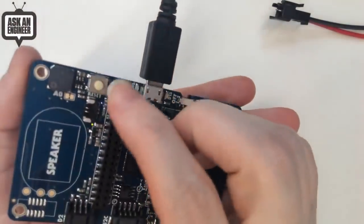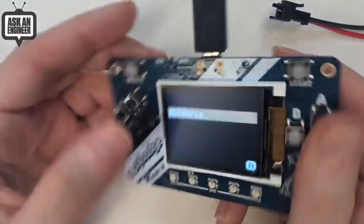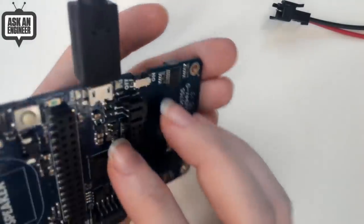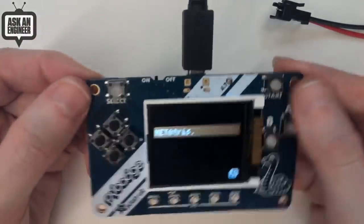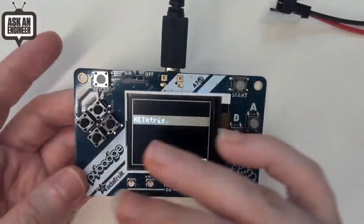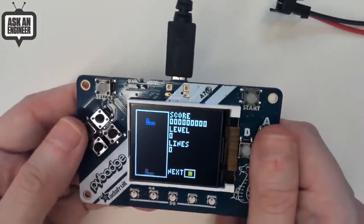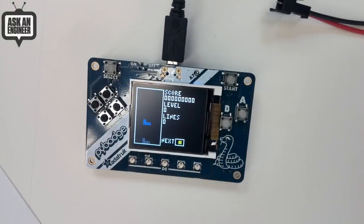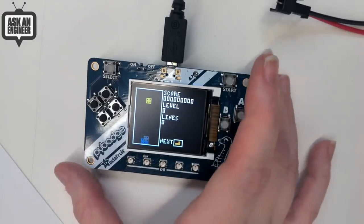You can put a larger speaker on the back if you want — there's a spot for one of our 8-ohm speakers. It has an on-off switch so you can save power. It can run off a LiPo battery — there's a spot for LiPo. It has an accelerometer and a light sensor — you can dim the backlight. With one of our 350 milliamp-hour batteries, I got five to six hours of game life. It has holes so you can mount it into an enclosure, or wear it as a badge, which I thought would be kind of neat. Especially with CircuitPython — it shows up as a disk drive, and you can have graphics, sounds, animations, or even play animated GIFs as a badge with the LEDs lighting up. It's coming soon so sign up. We did our first run and more are coming. We've got CircuitPython support.